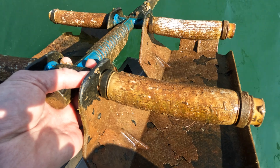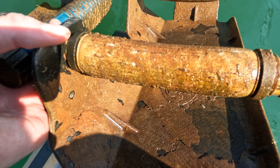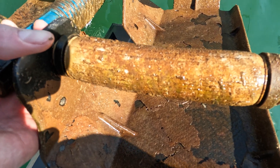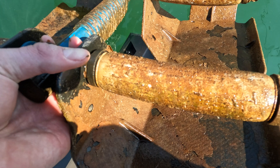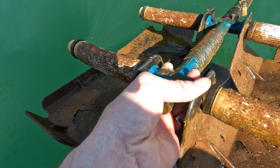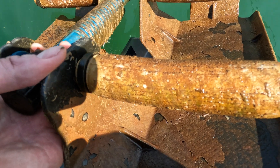As I was messing around with this, I got the anchor jammed right in the footings of the diffuser on my second attempt, and as I started to pull it up I was able to slowly lift it all the way up into the boat. This is a good look at what these diffuser wands look like - all the air bubbles, the diffused oxygen gets pumped into the bottom here. Each of these wands needs some cleaning, and this is a good annual maintenance for your aeration system - pull your diffusers up, clean the diffuser wands off, and you'll get a lot more efficiency.